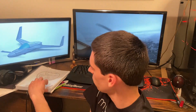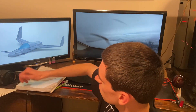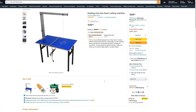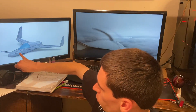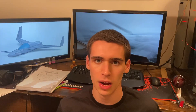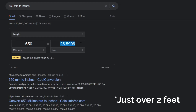Obviously, this task is quite extensive — I have quite a few chapters to go through. But one of the first issues I ran into was realizing that this shape has to be cut out of foam, and there's not really a foam cutter on the market that is large enough. A quick look through Amazon, I was able to find this one, but one of the longest single pieces of foam is this main section of the canard, or forward wing. Since this piece of foam is 54 inches long, that's how long the hotwire cutter has to be, at minimum, to cut foam of that length. When the largest one is not even two feet — yeah, we have an issue.